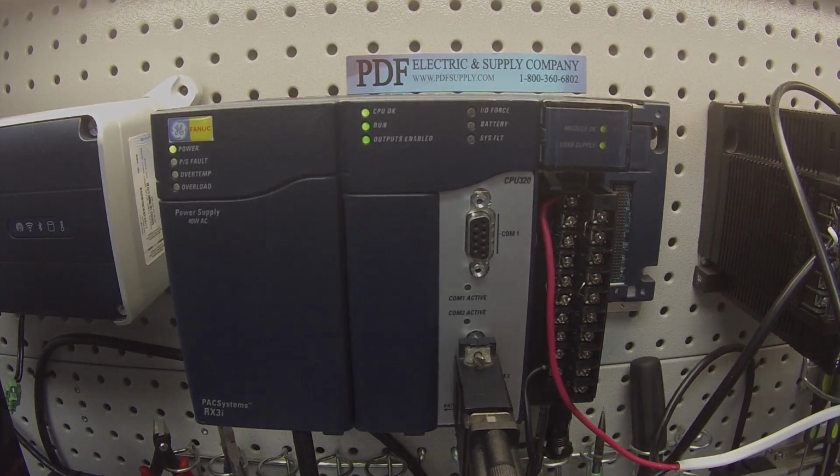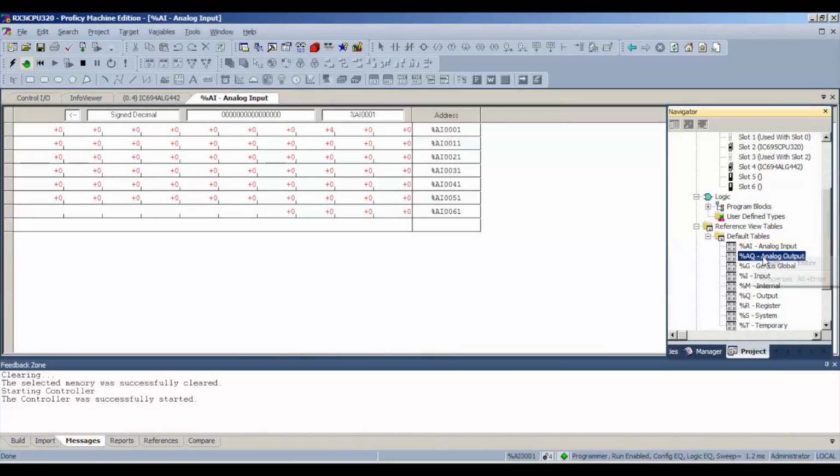And I'm going to open my analog output table so that we can give it some voltage. I'm going to show you how to do that here. Analog output 00001. And I'm going to give it the full 32,000 engineering units. Okay, so it's 0 to 10 volts output when it's selected for voltage. And that means when I probe my channels, my output channels, I should get a full 10 volts at 32,000